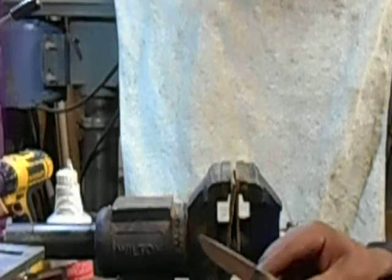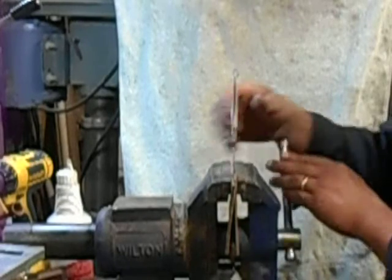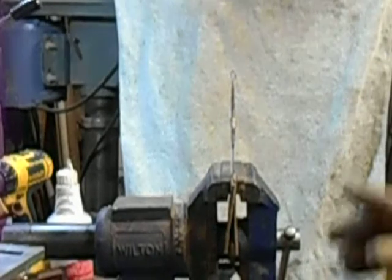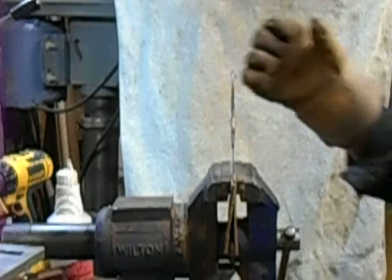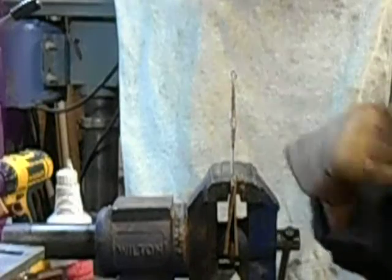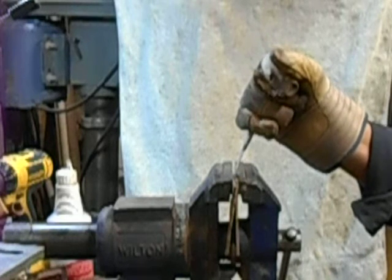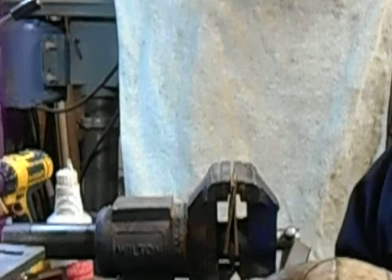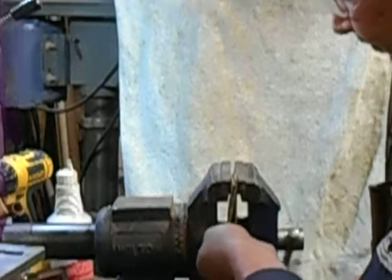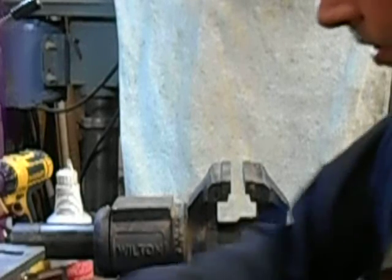Okay, now this one was 3/32 inch stock, and it was air cooled. It was heated in the kiln for 30 minutes and then just pulled out and placed tip up in the vise and let it cool to room temperature. It's also 3/32 inch stock, so it probably won't bend as far before it breaks. Of course, it is much harder to bend. Yep, it didn't bend as far. Grain in that one still looks alright, maybe a little bit coarser than the other ones.